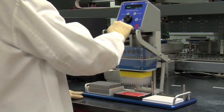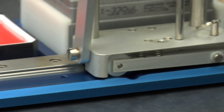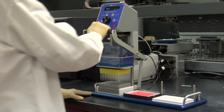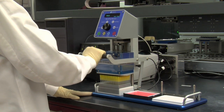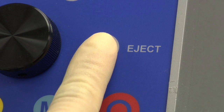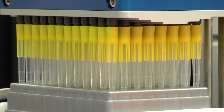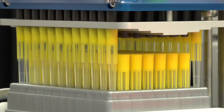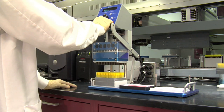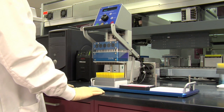With the pipetter raised to the highest position, slide the pipetter head assembly into the Notched Guide in Position 1 above the empty tip rack. Lower the tips so they are positioned halfway into the holes of the rack. Press Eject on the control panel. Once the pipette tips have been ejected, lift the pipetter head assembly to the highest position. This ends the basic pipetting operation.